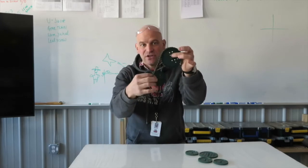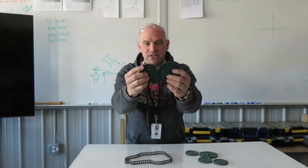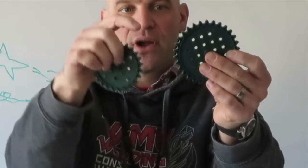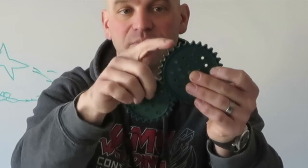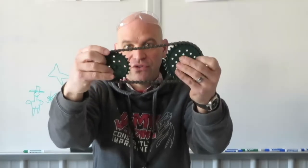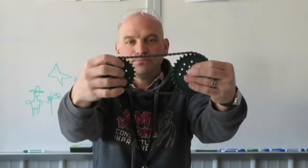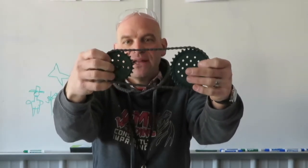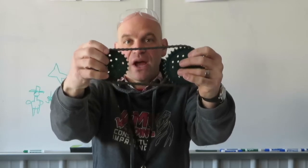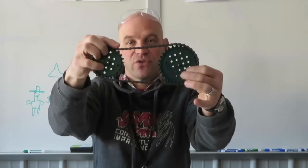So those are gears. Sprockets are meant to be used with chains. These sprockets don't have teeth that interlock so well. They have a rounded middle, or like a valley, between the points. So you can have a chain that goes on those teeth and on those sprockets. With a sprocket, they will turn in the same direction. They're not meshed, so they don't turn opposite — they will turn in the same direction.